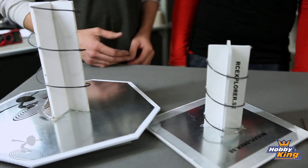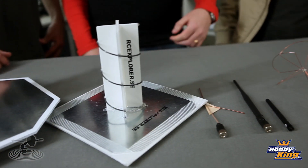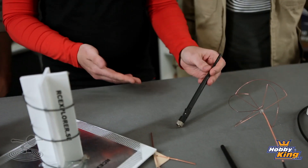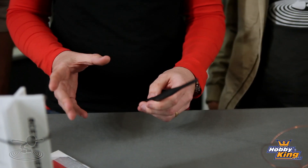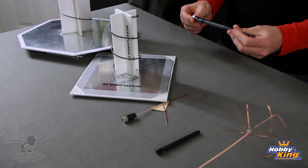They're actually circularized, polarized antennas, and they're used for a better FPV experience. For different people flying different things, obviously different antennas are going to come from that. The most common antenna is the one you get in your box from Hobby King. It's a standard whip antenna — it only has one active part. It's pretty wideband, but it's made to work bad on all frequencies, more or less. It covers the whole dynamic of frequencies, just not as good as it could be. It's a compromise.